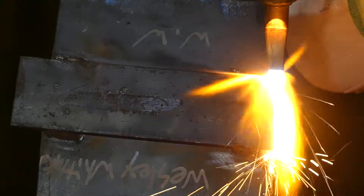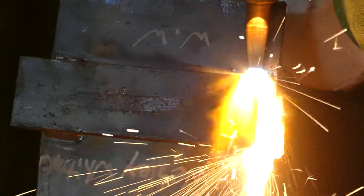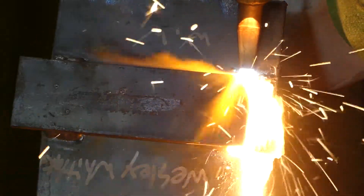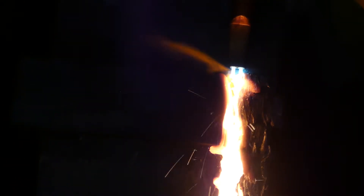Rotate the tip a little bit and slowly go across — this looks like cutting a piece of plate. Cut this rest off, go back and clean up a little. Watch on the bottom side to make sure you're not gouging into the plate. If you hesitate in one spot too long, you can preheat the plate underneath and you may get a chance of wash cutting into the plate.